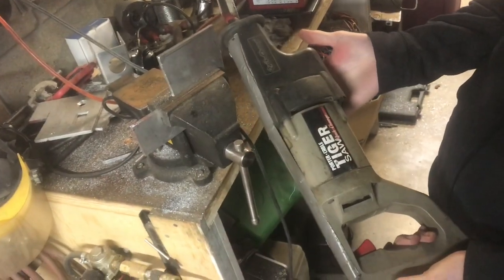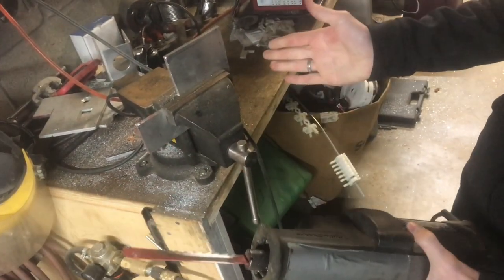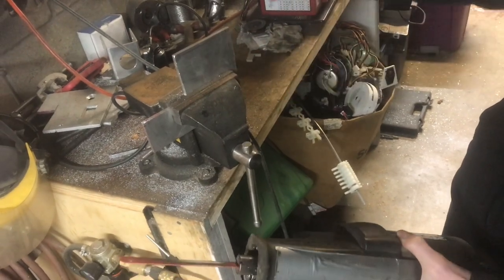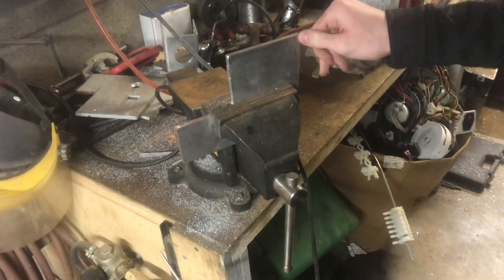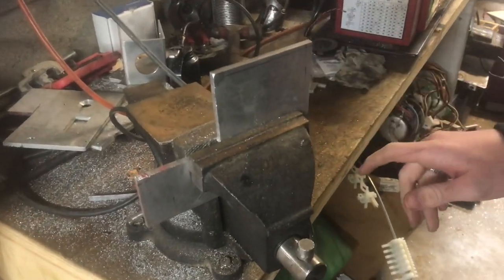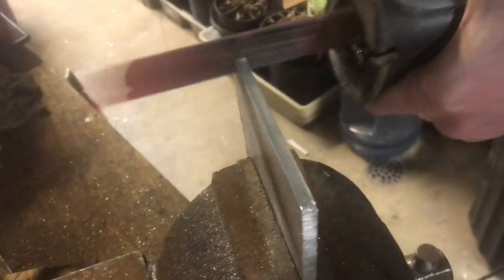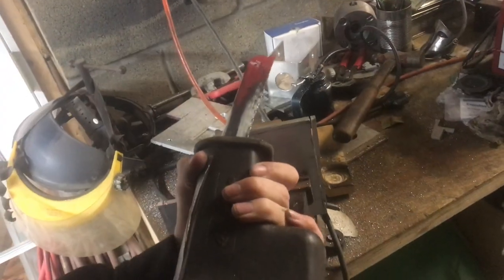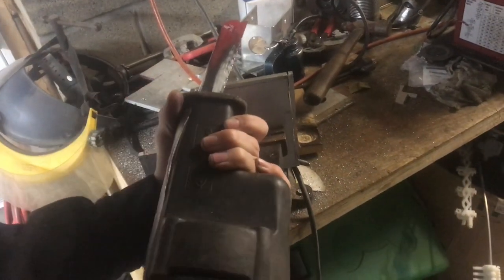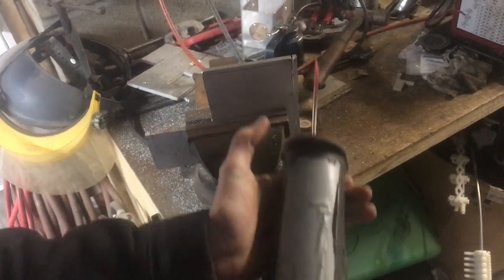This will just be a nice edge — not a precision machine here. I'm using the tiger saw just to rough it in more. I think one of the problems I was having when I was cutting it out of a big sheet was it was vibrating a lot when I had it clamped in the vise. So now I'm just fine-tuning that shape, and once I get it close enough to the line, I can just hand file it. These saws really cut just amazing, especially when you have a good blade. I have a Diablo metal cutting blade and it just goes right through the aluminum.